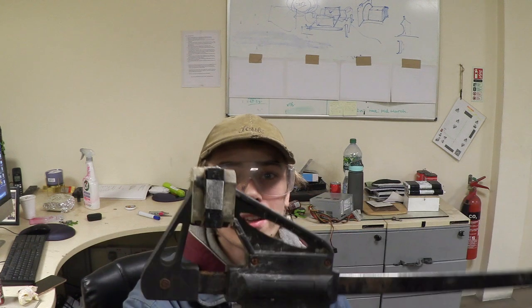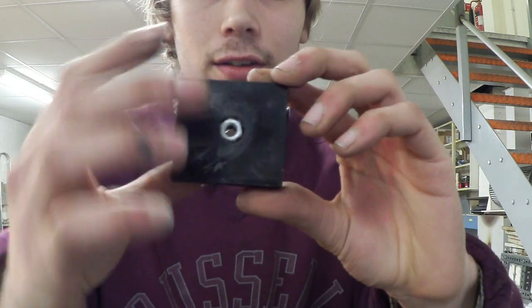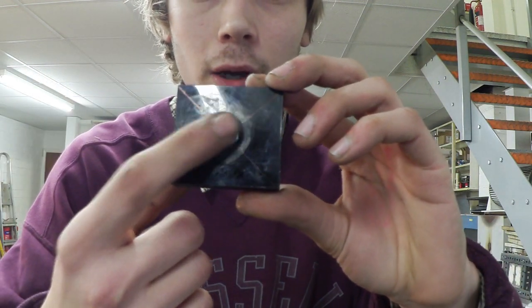The base and frame have had 24 hours to dry and now they are completely solid. There's one thing to note about the base — I drilled an M6 hole all the way through and countersunk it at 12mm so I can glue a bolt into the bottom. That gives the tripod something to screw onto.